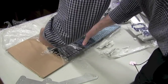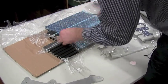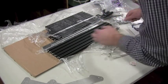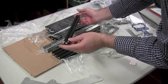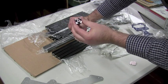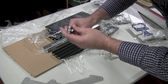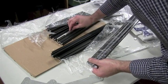Now I've got to try to get this off — back to the knife I think. And in here we have a whole lot of aluminium extrusions. This is what forms the physical structure of the Mendelmax, and it would be extremely rigid. You can see the cross-section on the extrusion — it's got the square section externally with these slots, which will make it very easy for putting a nut inside there and tensioning up against it. There are a whole lot of other extrusions here cut to different lengths.